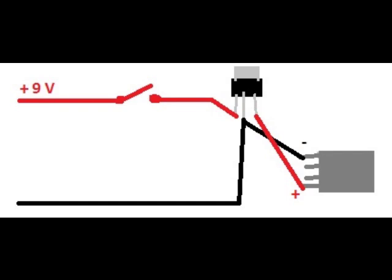This is the schematic for the charger. One important thing you need to keep in mind is the way that you face your 5 volt voltage regulator. The way I have it in the schematic is with the writing facing the front and the silver backing to the back.